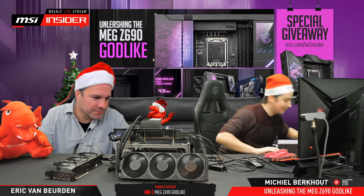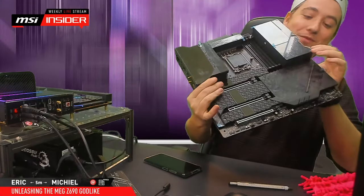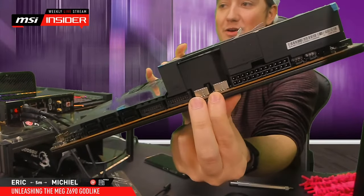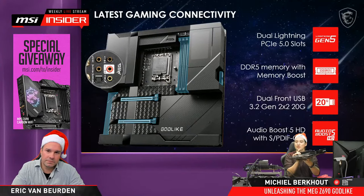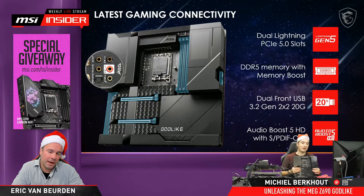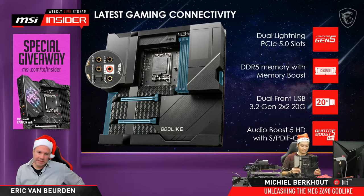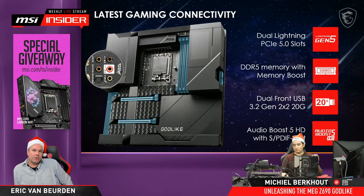Now let me grab this board, because yes, I've got 2 Godlikes today. It's a little bit easier to show you. Those are the front Type-C headers. The dual front Type-C headers can both support up to 20 gigabits per second. I think this is the only mainboard on the market that has that, right? I believe at this point it is. I'm not 100% certain, but I haven't seen it before. I have seen front USB 20G, but it's still quite limited. Only a couple of motherboards have that nowadays. The problem is also that you need to find the right case, one which not only supports 20G USB, because it needs to have the right cable for the signal strength.